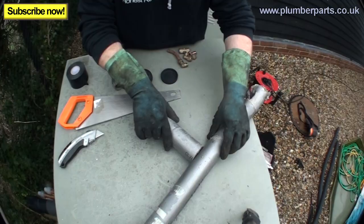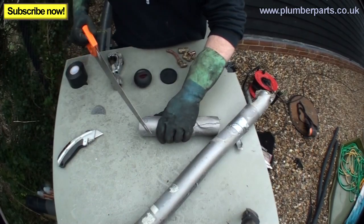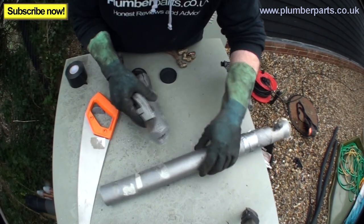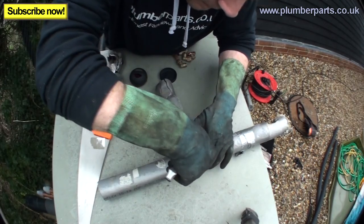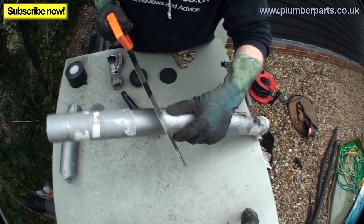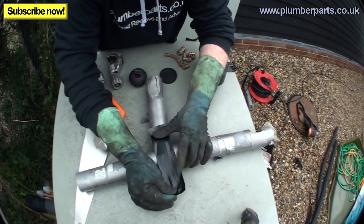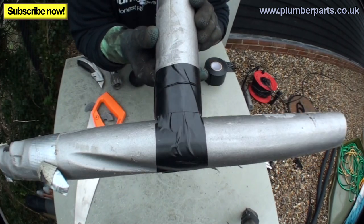So now I'm going to show you how to do a good tee piece joint just like this. Cut yourself a 45-degree cut like so, and then another one just like that. Make sure you've got your slit pointing up — this is actually where you want to make the cut. Just make a little mark there and you've got your cut area. Now you've got your nick there, just lay this so it's just over that nick. Then with a small knife just mark exactly where you want your cut to be, follow that line in, and do the same again on the other side. There'll be a nice little hole there for the pipe to stick out and connect in just like that. Then for the taping, just have one piece that goes right over the top and go round — and there you go, that's how you actually do a T-piece nice and successfully when you want to do pipe insulation.